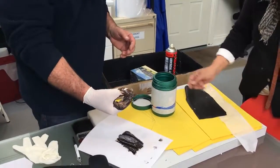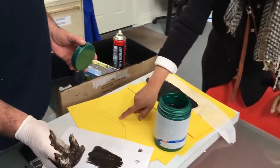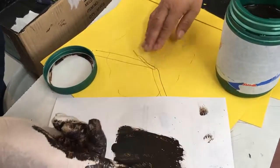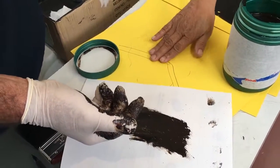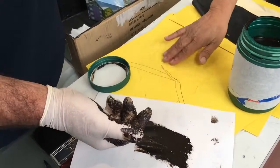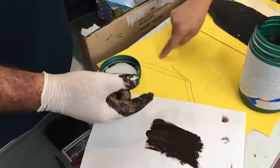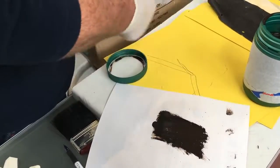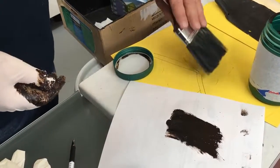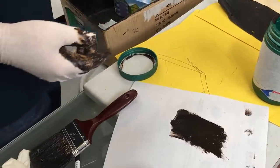Just when you're coming back to this, the very first bit, you said you can put the product inside the damaged area and around. But you're also giving it a good coating of around 5 centimetres beyond, as well. So with the brush, you're coating 75 mil each time, with a 3-inch brush. So you can't help but get 75 mil width to start with. Your bandage is 100 mil actually.